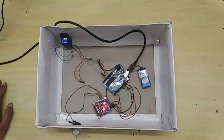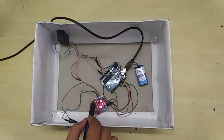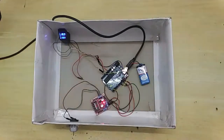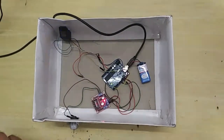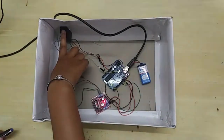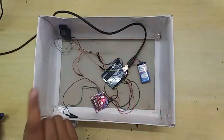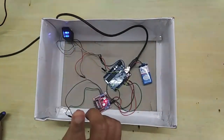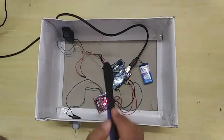Let me explain to you the actual hardware and how it is working. Here is a fingerprint sensor, an Arduino Uno board, and an IC which is doing the current boosting in the system. The Arduino board is the heart of this system. In the fingerprint sensor, first of all, by using the enroll code, the user of the car will authenticate and store their own fingerprint. In the second code, when we are going to use the car, we need to authenticate using the stored finger. If the authenticated finger is placed, then the motor will start and the ignition system will start.